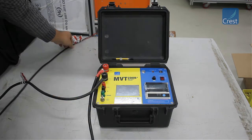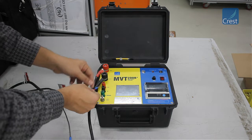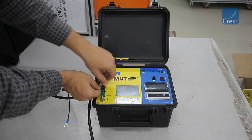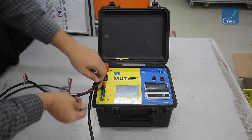Connections should not be made on any bolts or screws connected to the flange of the device under test. Connections should be made directly on the flange. Also, ensure that there are no loops in the current or voltage cables while making connections to the device under test.